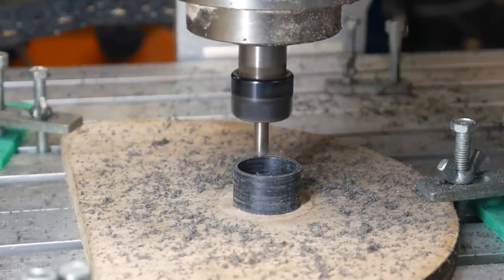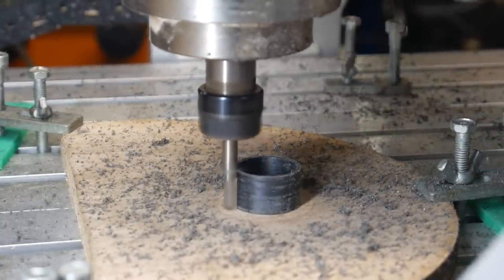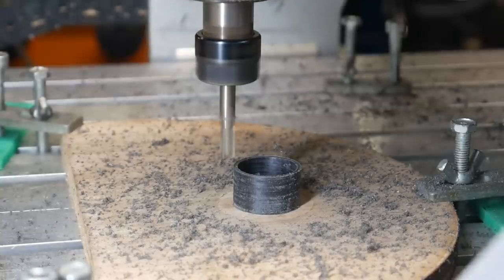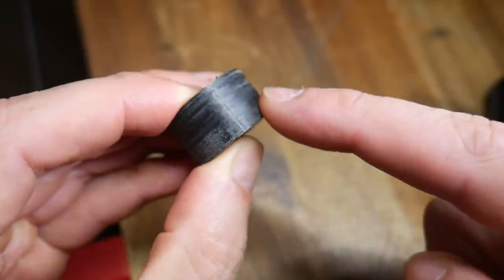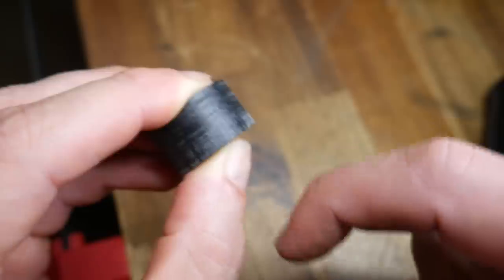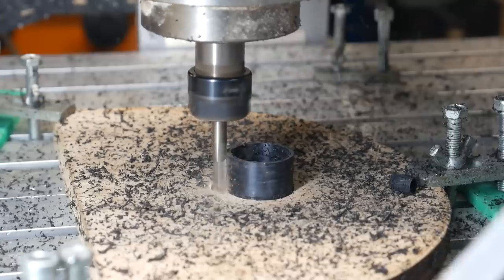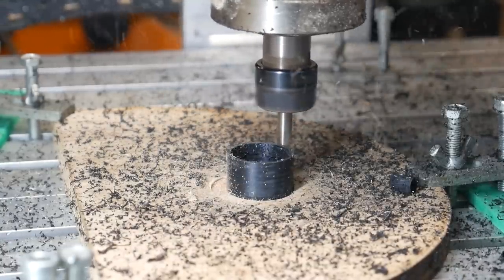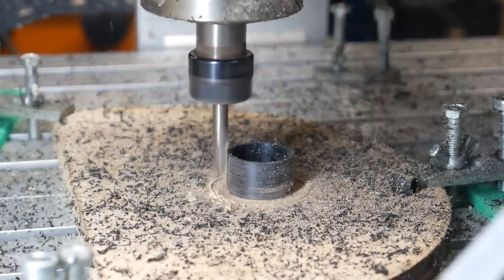And this proved to be a successful combination, with my first wheel actually completing without any failures. Well, almost — because an error I made in setting up the job in DeskProto left a very small lip on the bottom of the model that wasn't cut. You can't see it, but you can feel it, and it's kind of like elephant's foot. For number 4, I lowered the depth of the final cut. This made a mess of the spoilboard, but that's its job, and its sacrifice ensured the wheel had the same diameter the whole way along its span.